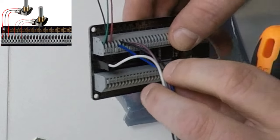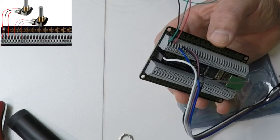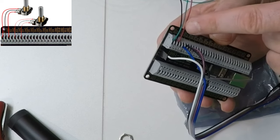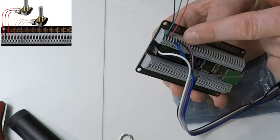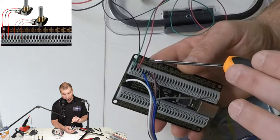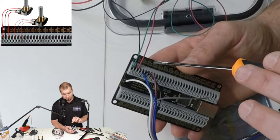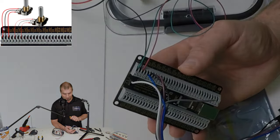There we go. The next wire we're going to wire up is the purple and that's going to go to the opposite turning direction. We're going to wire that up to the very next positive terminal that we have available on the board. So that is going to be B4. There we go. So if we take a look at the board, we have the first three encoder wires connected - positive, ground, positive. And we have the second round of encoder connected - positive, ground, positive. It does look like all the laser etchings do line up perfectly with the corresponding pins and that'll help keep everything in order for us.